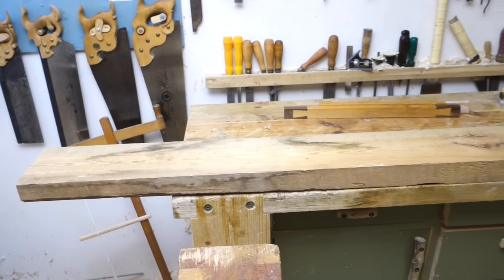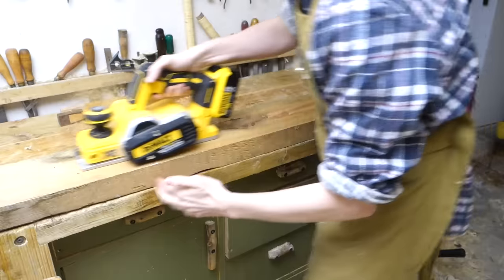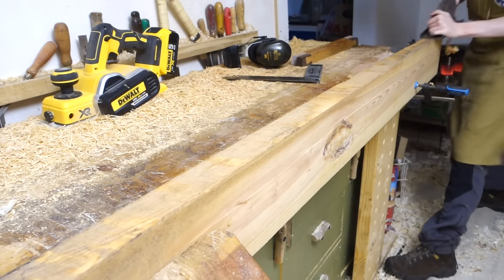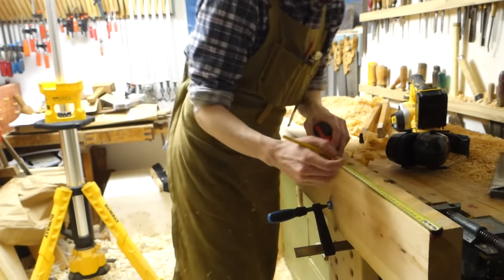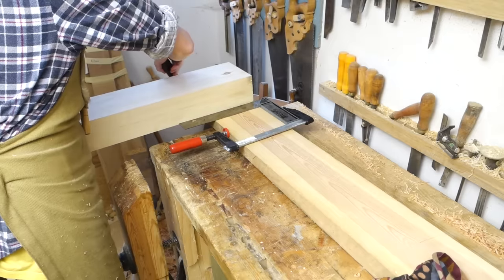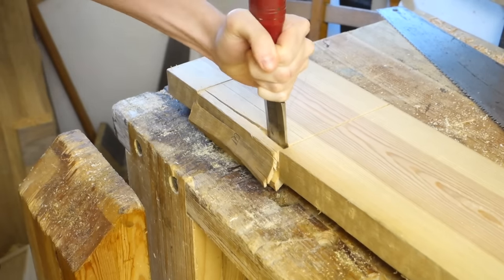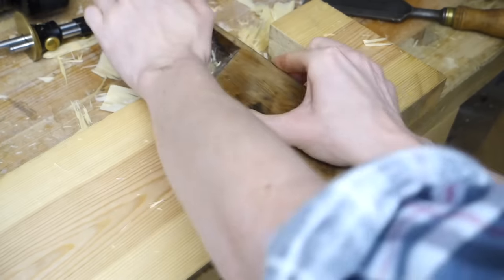This next part is one of the stretchers. This is pine, and we are not done adding more wood species yet. There is a whole forest in this bunch. Anyway, you know the drill, no board is left unflattened. Then I'll measure and mark where the legs are going to join in. This will become a T-bridle, which is a joint with a lot of shoulder area and therefore very strong against racking. This joint is used on the two back legs below the tool well, but I'll be doing something different on the front legs.